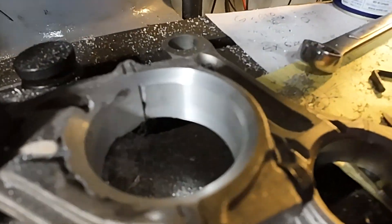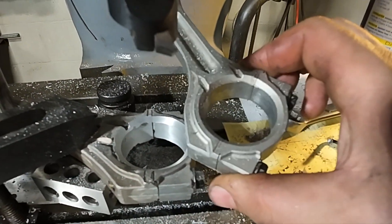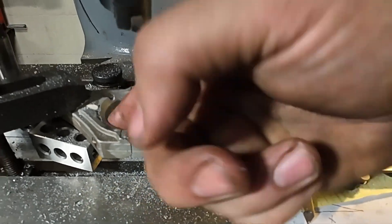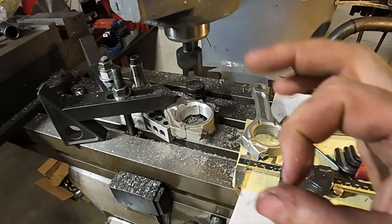That's a plan that actually came together. Look at that chamfer — better than the factory cast chamfer. That looks awesome. We did end up with a little low spot on the bearing right at the edge, but I'm not worried about it. I've got to flip the rod, do some machining on the back, but I think we're there.